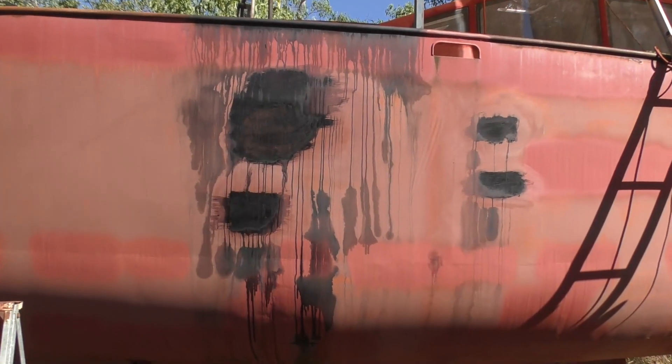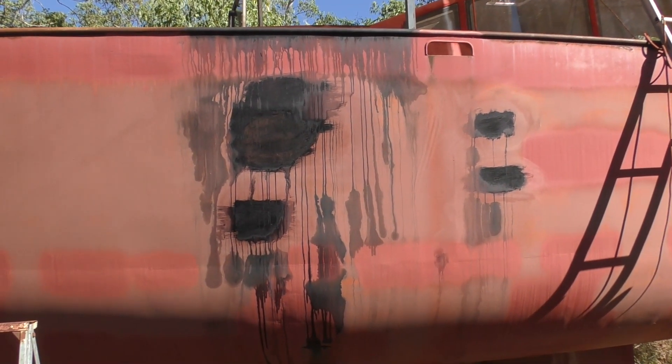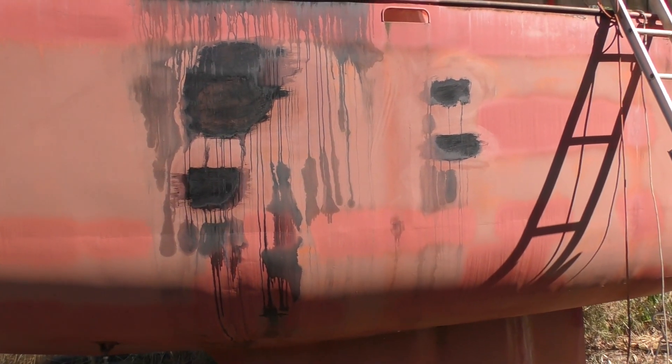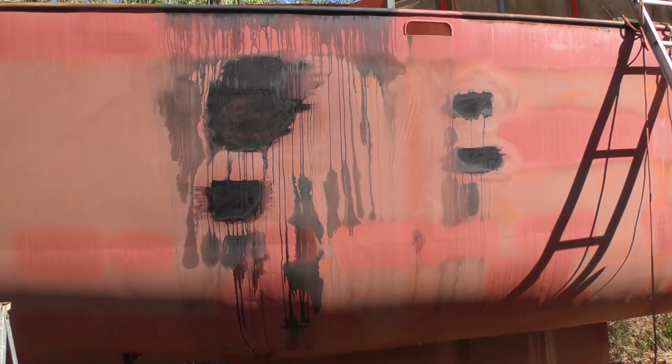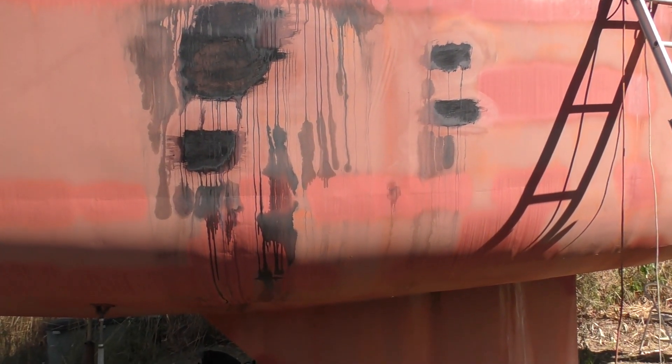It's not a final treatment solution — it's a way of keeping the rust at bay and keeping on top of it until I'm ready to clean right back and do final priming, undercoat and top coats. After 8 years it's still in very good condition, very little rust to be of concern about. One of the first things I've done recently is I had some very light surface rust come through the primer where it's slowly degraded over the last few years, primarily because of the UV and heat from the sun. The steel gets so hot, and it does affect this holding primer that I just top up every now and then.